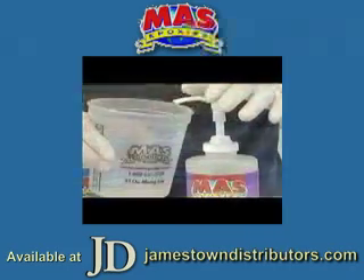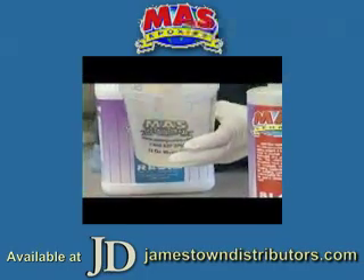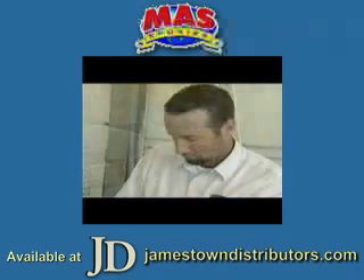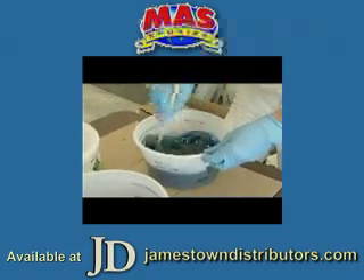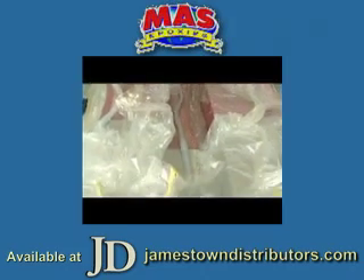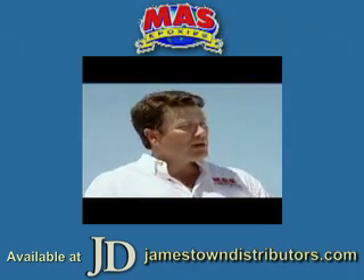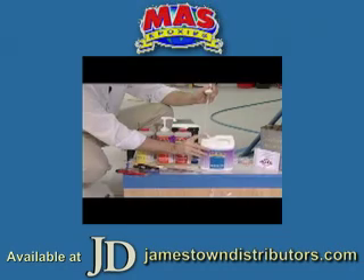J.B., your company makes epoxy resins, and this is what you generally use for a resin-infused part — but you actually make a special type of resin for infusion. Sure. We designed specialty resins for infusion because infusion resins have to be very low in viscosity, very thin, so they can flow through that fabric. And we control the cure cycle — here in Key West it's pretty hot, so we use a slower hardener. If we were in Portland, Maine, or Seattle, we'd make a faster hardener. We customize it because we have to have that thinner resin to flow through the fabric.